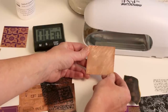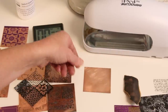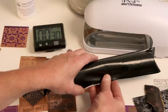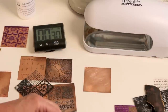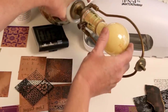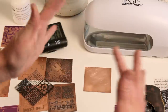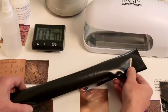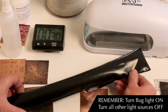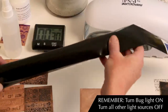The UV film needs to be kept in a cool dark place because heat and light will expose and destroy your film. The film comes in a black protective plastic coating to protect it from the light. You'll want to work in the dark with a bug light on — a bug light emits a yellow light that won't expose the UV film, giving you plenty of light to see what you're doing. Before you open your film, make sure the bug light is on and the house lights are off.